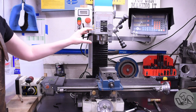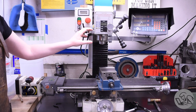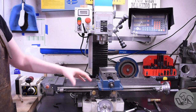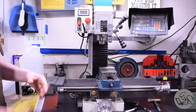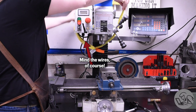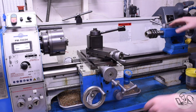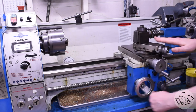I'll refer you to vintagemachinery.org — Keith Rucker there has an amazing resource of old machinery manuals, so you can almost certainly find your machine in there or one very much like it, which will at least get you started on the safest way to lift it. The rule of thumb for small hobby mills is: first, take everything off that you can — take the vise off, the DRO maybe should come off — then lower the head as far down as you can go. Generally, you're going to want to put your lifting strap under the head, being careful not to lift on the electrical box. For lifting small lathes, move your tailstock all the way to one end and lock it down, then move your carriage all the way to the other end and lock it down.